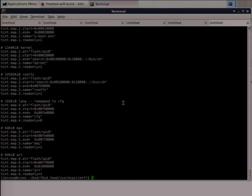Do you guys kind of understand what that's doing? It's very, very goofy. So it's saying your partition is going to start at that address into flash, and then I'm going to search in starting. The end of this partition is going to be starting somewhere around here, searching in this size for something that looks like that in text. Okay? So in other words, when the kernel boots up, it's going to go, oh, well, I think the kernel ends here because I saw this, and this comes out of the very first thing that's in the file system.